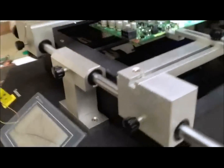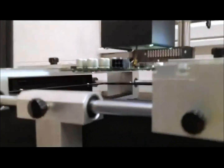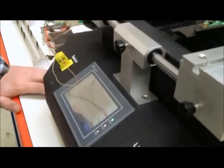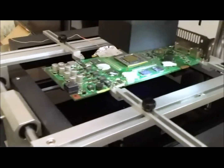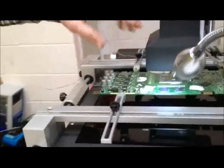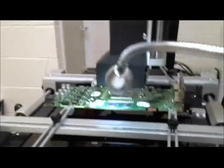Essentially this is the Bird 8888. What I've done with this one, I've just set the profile so the middle heater is on to focus the heat in the middle — it's only a small board. And we'll just lift this chip off; it's an old graphics board but I want to take the chip off and save the chip.